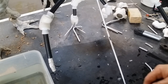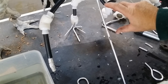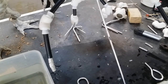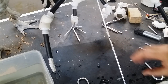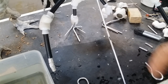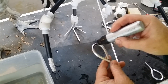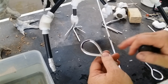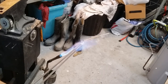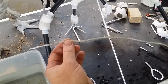So here's a tip for you for making up the thicker armature wire. The extruded rod stuff that you can buy from most hardware shops can be annealed to a point where it's really soft and malleable simply by heating it up and then rapidly cooling it. And that's pretty much true of aluminium in general if you want to make it softer and easier to work with. A good way of gauging the temperature for when it's ready to be quenched is to put some black marker pen on it. As you heat up the metal, when that black mark starts to disappear, you'll be at the right temperature for quenching in the water, and that will soften up the metal so that it's ready for use.